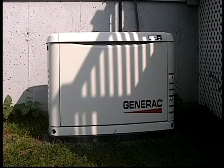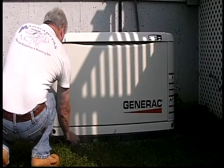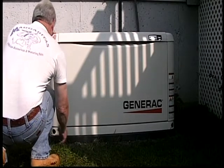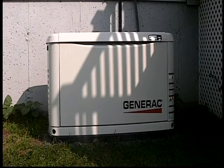I put a stone base to allow for vibration — all generators vibrate. When they vibrate, they'll dig down below ground level, hopefully into the stone, and then not really move anymore. Right here I have some pea stone, river stone. The stone actually fills a void — there's a small void on the underside of that composite pad.